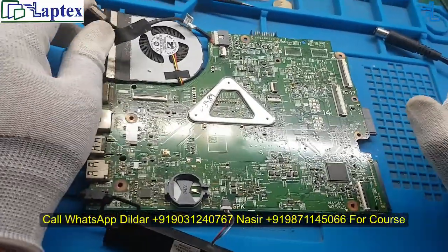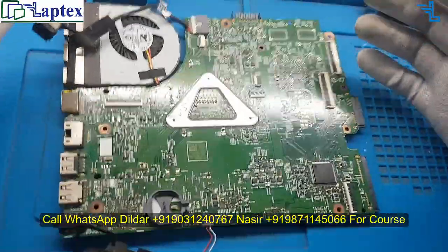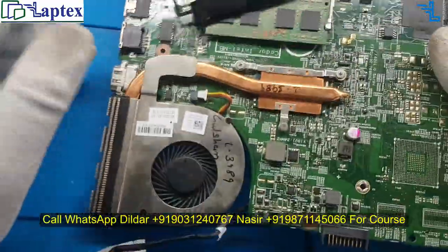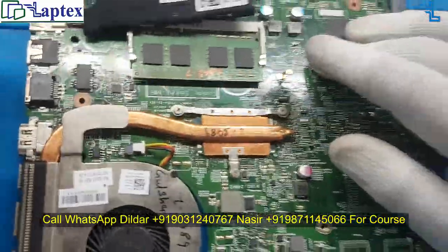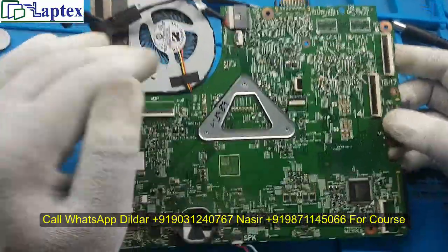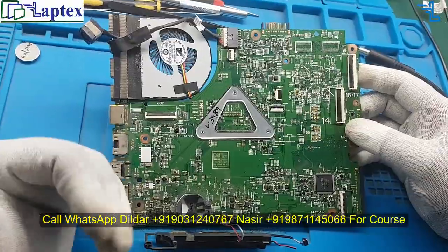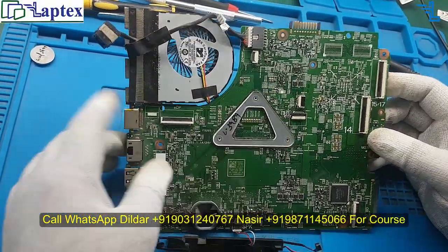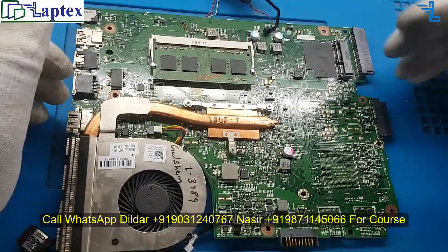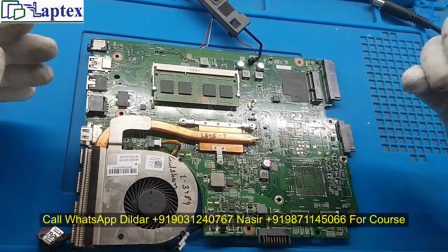I would like to tell you that if you work recklessly on a hit-and-try method, what will you do? First of all, you will reprogram the BIOS. Sometimes you may change the CPU, even though the CPU voltage is generated in this motherboard. You will look around the motherboard, get tired, heat up and boil the PCH — and that could be the cause of a dead board.